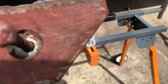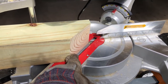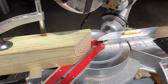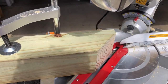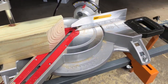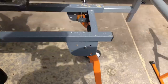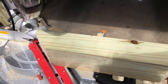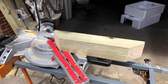I did have to adjust the slide just a little because one part didn't cut all the way through - that's what the slide is for on a 12-inch blade. My first line wasn't quite lined up, so measure twice, cut once. These pieces are symmetrical - sort of mirror images - so I laid the piece down on its other side and cut the other side going the other way.